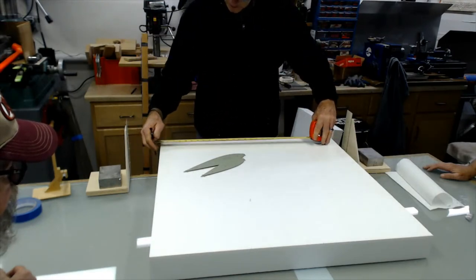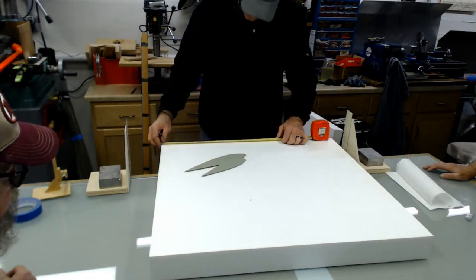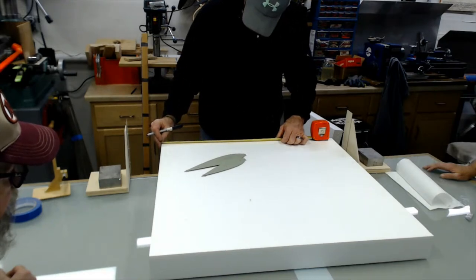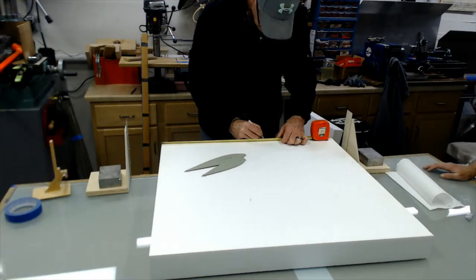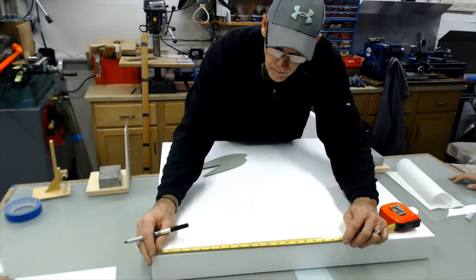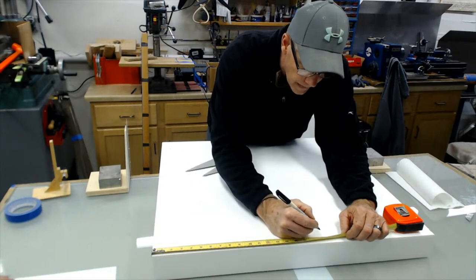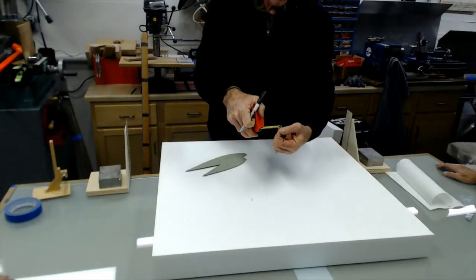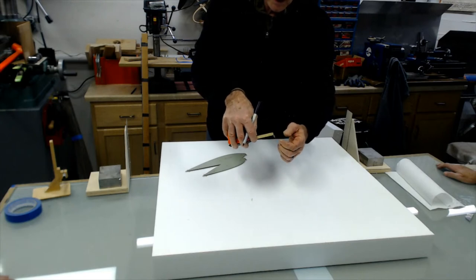One of the things that I never knew till late in life is the reason they put the slop on these tape measures. Yeah, inside outside. A little trivia. People look at that thing and say, man, these make these things cheap. Look at how much slop I got in the end of that tape measure. Yeah. That's what Sparky was saying, this slop here. Should be a little slop. This one's tight, but basically you got inside and outside dimensions.